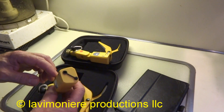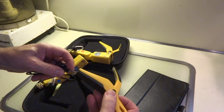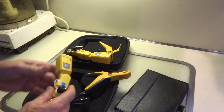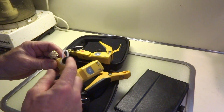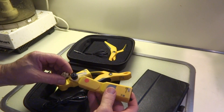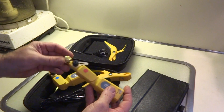When it came in, one of the units was on and the batteries had died. There's a little screw and two double-A batteries inside. It's not fully wireless because you do have to use this wire for the sensor — there's a little sensor in there. I hooked it up to the app but haven't used it in the field yet. It's adjustable both ways and has a tap so you can fill with gas on the low side or remove gas on the high side if it's overcharged. Since it's straight, sometimes you can't hook it up to certain units, so I use flexible hoses. They do have 45-degree shutoffs you could use, but sometimes straight won't work.